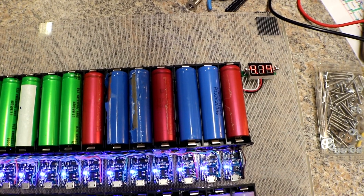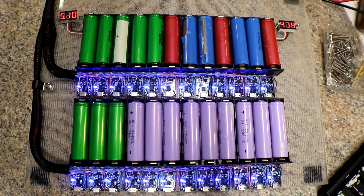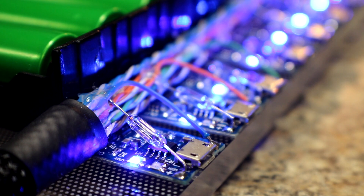So you can do a quick check on your battery voltage with that one right there. I tried it out last night and didn't let out any magic smoke, so everything is good. You can see how each TP4056 has its own fuse — those are the fast axial glass fuses. For the wiring I just used ethernet cord; I stripped out the outer insulation and used all the wires inside. Each TP4056 has its own wires.